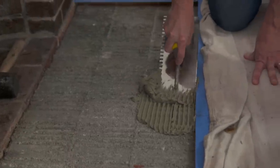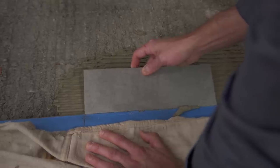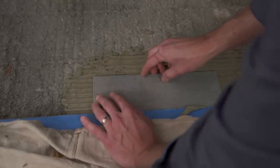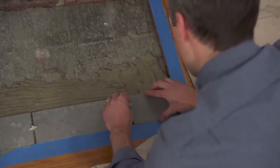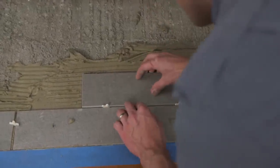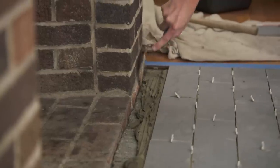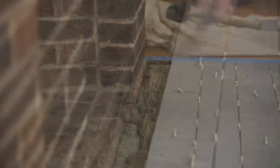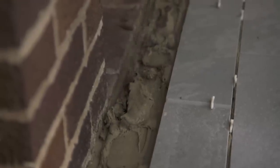Notch side down. The notches on the old grout are really going to benefit us because they'll grab the new thinset we apply and give a stronger base for the new tile. What I want to do is dig out that crack, because it's actually not part of the sub-hearth — it's part of the grout from the old tile. So if we dig it out and pack it very tightly with the thinset, we're going to cover the fact that we did have that break.